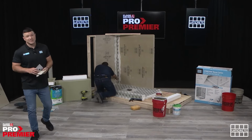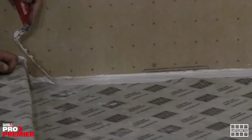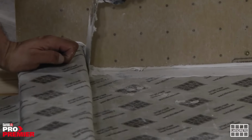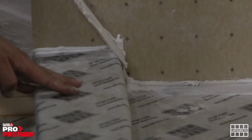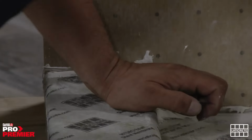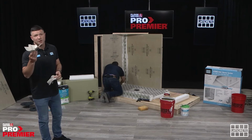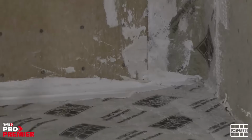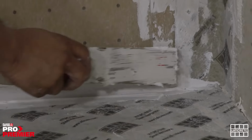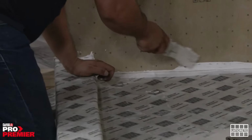Another option to do that, as I spoke about earlier, is the inside-outside corners that do come with the kit option. They also are sold a la carte, available both in-store and online. You have the ability to drop these preformed corners directly into or over the outside of a curb or the inside of the transition points, and they act much like our sheet membrane and shore up those areas of transition.